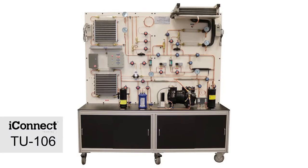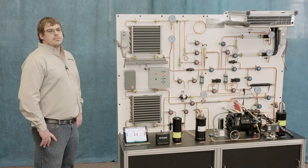The beauty of the TU106 is you have a complicated piece of refrigeration equipment right in the classroom. You can read about it, study it, do your book work, and then turn right around and actually see it in action. You can interact with it — use different types of expansion devices, measure different sensible and latent heats. There are detailed exercises for that, and as students get a good handle on these concepts, they can apply it directly with the TU106.